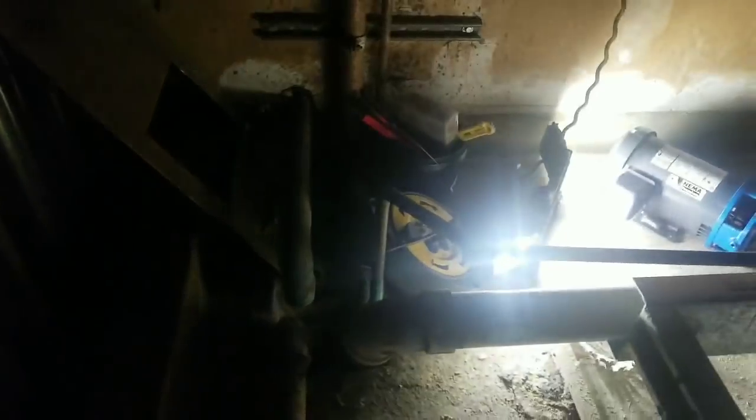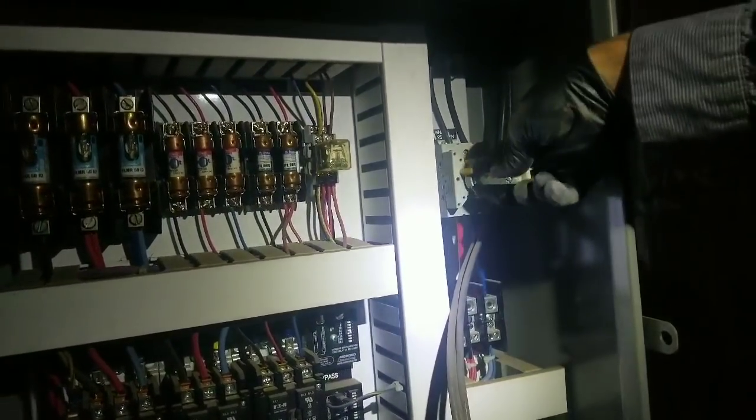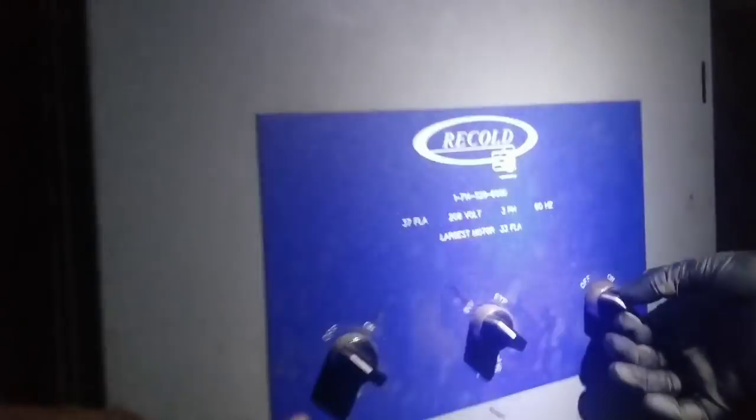I am working with a helper today, so I'm going to watch it while he opens it. Now we've got water coming out — water draining now. Now that we're draining the water, we're going to shut main power down to the tower — that's a nice disconnect we have there — to make sure the fan motor and the pumps don't run.